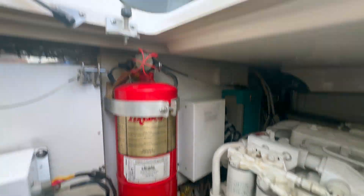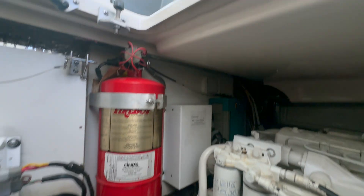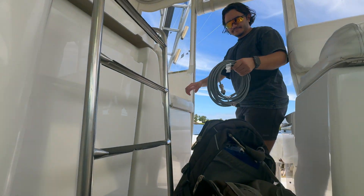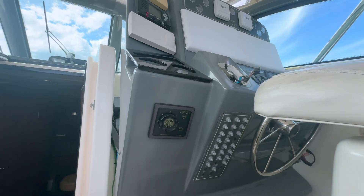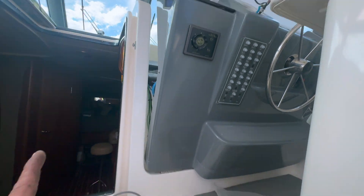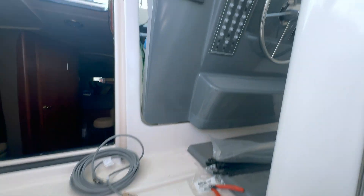This is our bulk cable — it's only a short run, maybe seven to ten feet. We're going to run our own cable, put two ends on it. Nicholas has his harness. This backup harness goes from the processor portion into the bottom of that control head over there on the wall with the pink plug on it — that's the backup head. Today we're going to have the system operational with the main helm station. We just need to run two more harnesses, put two field connectors on them, and then we'll be able to power up the system.